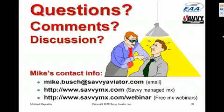Okay, Jose would like to know, when checking mag external timing, is it absolutely necessary to use a prop hub degree indicator? Can one just rely on flywheel marks relative to the engine split line? My Lycoming has the flywheel timing marks. You know, I don't know the answer to that for a Lycoming. I know on Continentals, Continental came out with a service bulletin that said don't use the timing marks because they're not accurate. I honestly don't know the answer on the Lycoming, whether Lycoming allows you to use those or not.